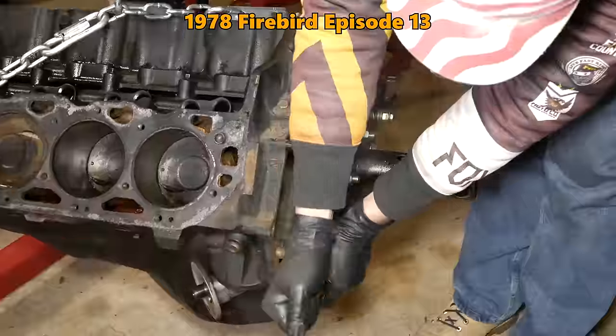Here's a set of those arms off of a different engine stand where they were far, far worse, to the point where I didn't feel comfortable using them, even if I sanded them flat at the ends. To repair these, I completely cut off all of those spacer tubes, cut and sanded them to the point where both ends were square, and then used a bolt to hold them in place while they were welded back on.